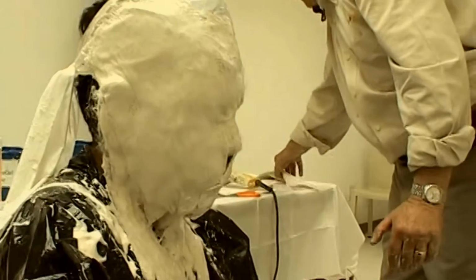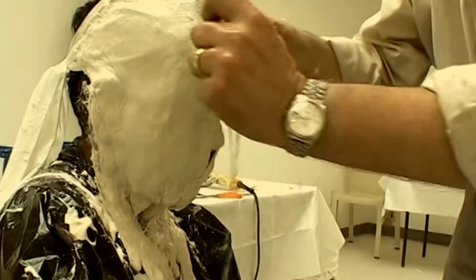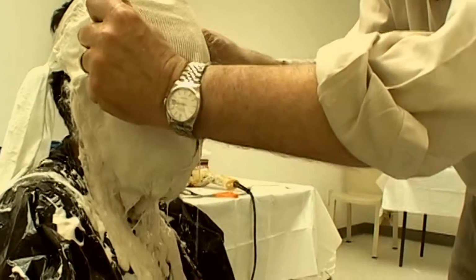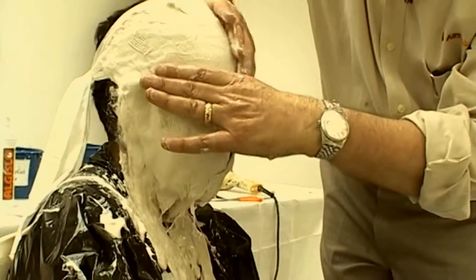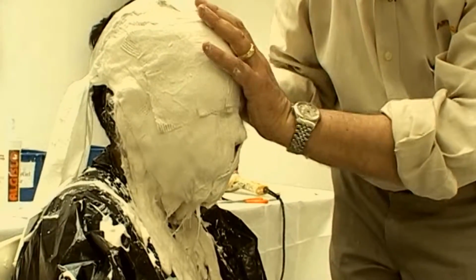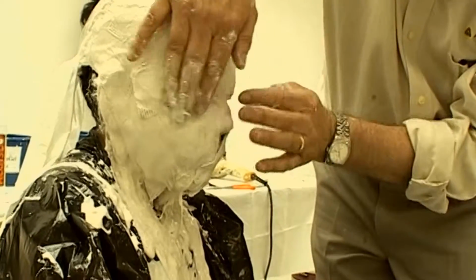That's topped off with a 9-inch bandage across the forehead until the entire head is outlined. This layer is the print coat. It's important to smooth each bandage down against the surface of the fibergel, as any air bubble between the bandage and the fibergel results in an unsightly mold dimple.